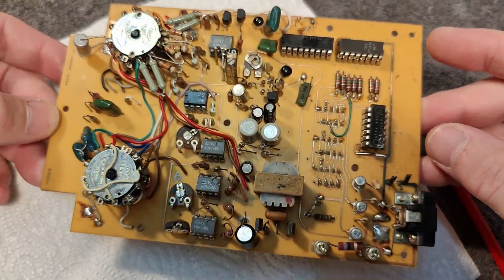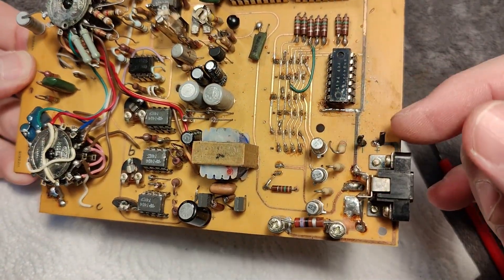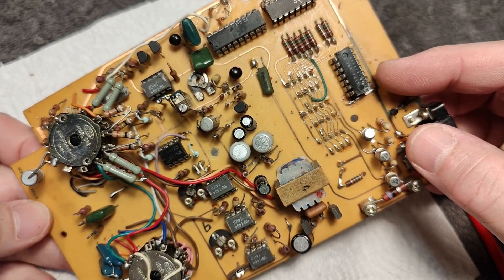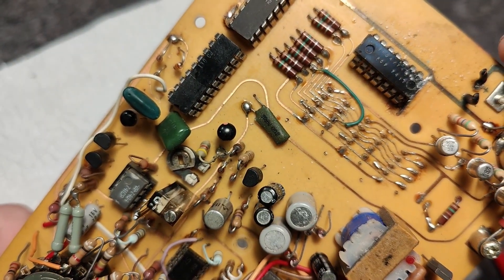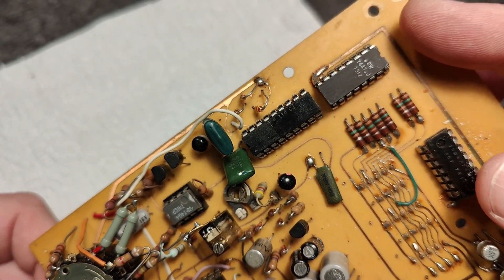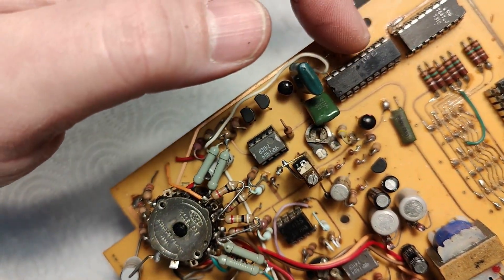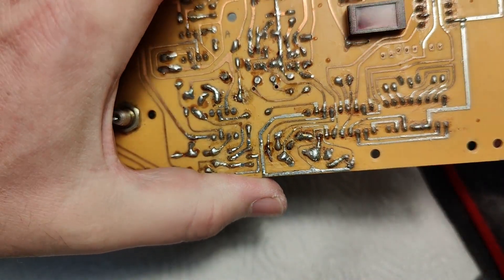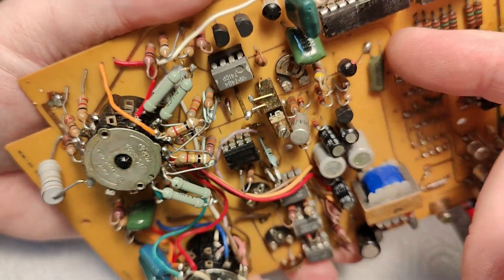I removed the battery pack. Let's see if we can get a little better light — we can see the corrosion also dripped down here on the circuit board, so I need to clean that. I can't really make much of that chip marking — maybe 7417. This one is the BCD to 7-segment decoder, and here is probably a meter chip or something like that with BCD outputs, so we should find some signals going back and forward here, doing all the multiplexing inside this chip.